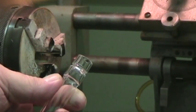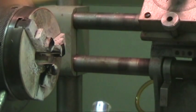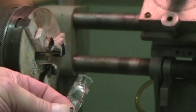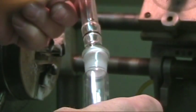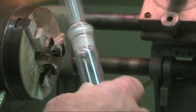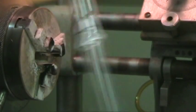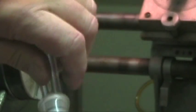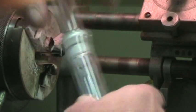The idea of this joint is that you get a nice tight seal. You don't have to push things together to where they lock up and can't come apart. It's a joint with a groove in it — put your O-ring on it, put it in a 19mm female. See how it sits up just a little bit above. Give it a little twist, lock it in. Stays in very nice, gives you a good tight seal, but just comes right apart. No scratching, anything.